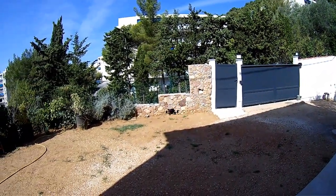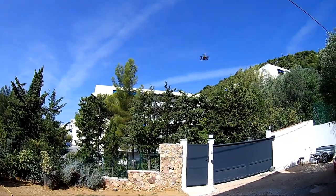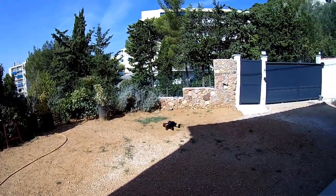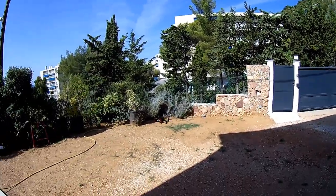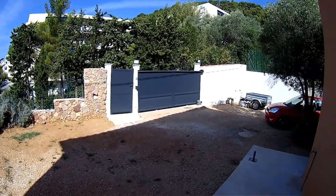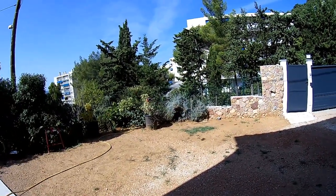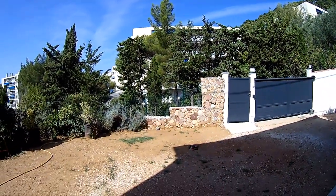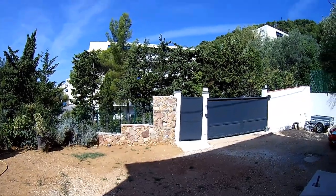Oh, you can hear some strange yaw jitter. Oh my god. It's not catastrophic, but it will require some tuning, okay? And the trick is to not tighten the flight controller installed on the top very strongly, because if you tighten it very, very strongly, you will get some oscillation in the jitter section. Well, it's almost flyable, but you can still see some sporadic yaw movement from time to time.